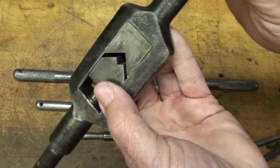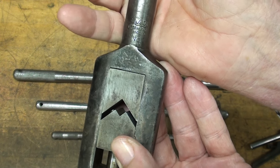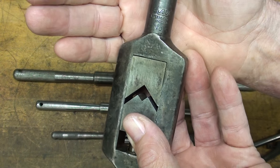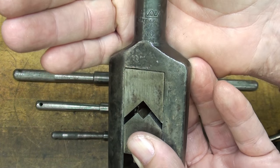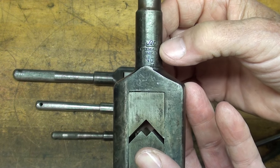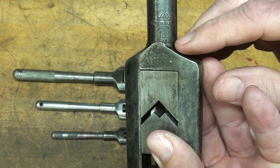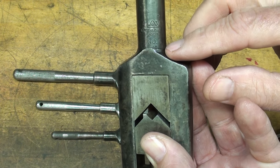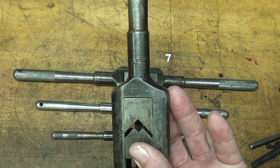It's interesting to notice that on this one — I had to buy the whole screw plate in order to get this. It was an old wooden box but I left it for the next customer because it was incomplete and had those carbon steel dies, which I'm not interested in. But this one is apparently misstamped. It's off, rotated a little bit, and it goes as far as telling the number, but the number itself is missing, and it says 'made in' but the USA is not showing. So that was misstamped 75 years ago, but it is a number 7.